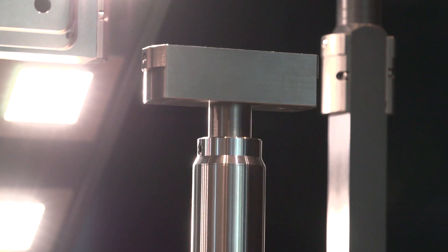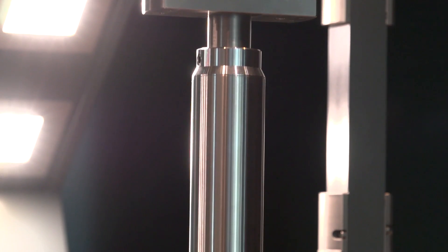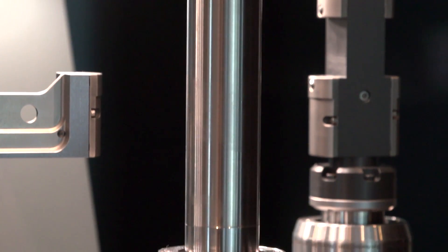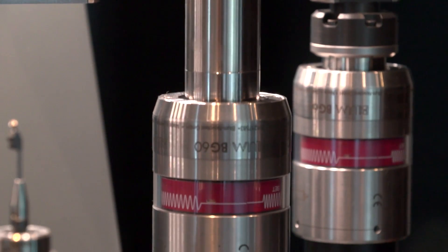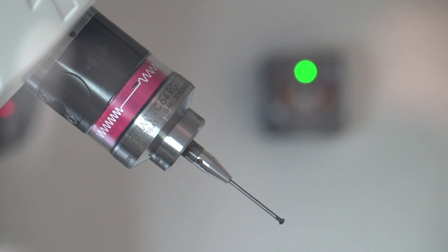And this is DigiLog technology? Yes, it forms into the DigiLog range of products. You have two measuring sensors — well, we can have as many as needed but the standard is two. As they compress into the bore, it feeds back an analog signal to our measuring device within the head, which is then transmitted via radio waves to the receiver unit.